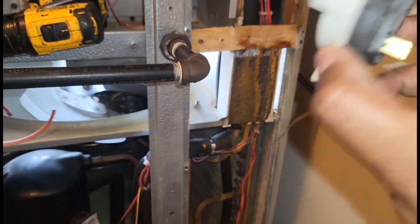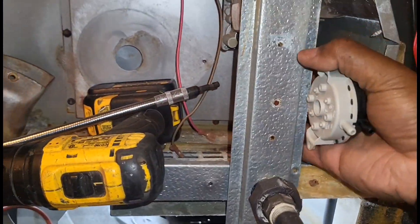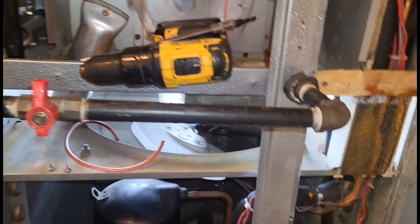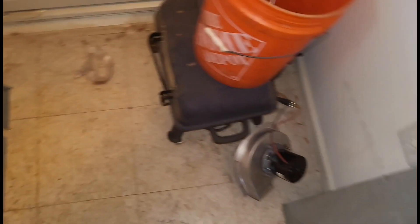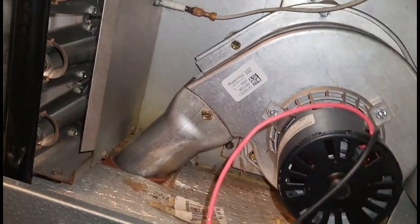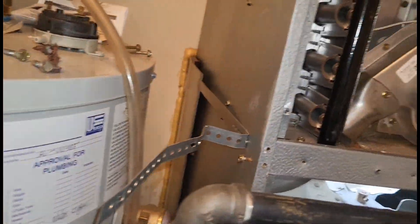I think I shook this up — I need to make sure the switch is open. This bad boy is going to go right here. Something fell on the ground — looks like a spacer that goes right here. Let me mount this pressure switch and get this show on the road. Alright, I got my inducer motor on, new pressure switch in, and the baffle around my gas valve screwed in. There's nothing to it — just plug and play. This is the OEM inducer so the new one fit right in place of the old one with no modifications. Now I just need to put the bottom cover on and wire this inducer motor in.